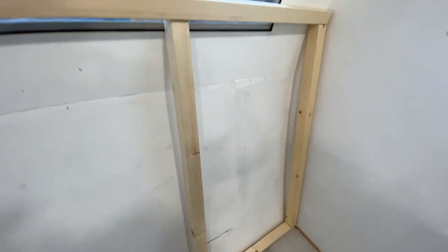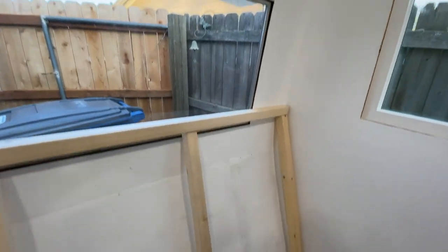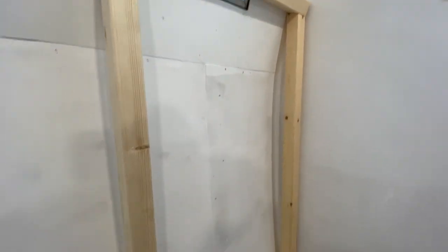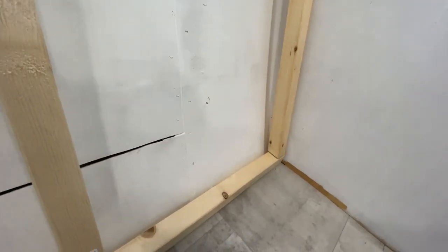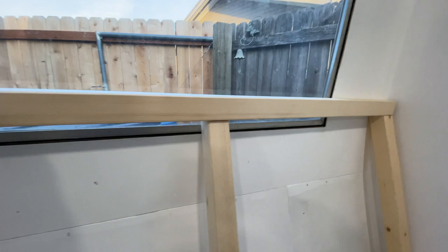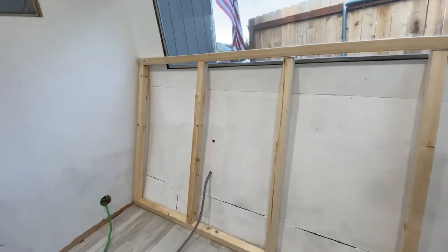As you can see, this part being the heavy curve of the trailer is pretty tricky. I didn't want to try to bend these boards, so what I did is I just cut a slight angle here and here so this could lay flush. I had to do it with each one of these — that's just for the front of the trailer.